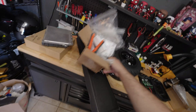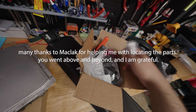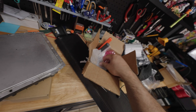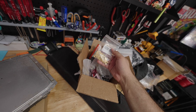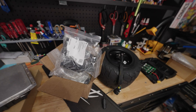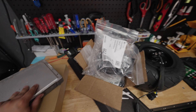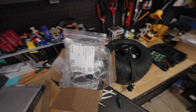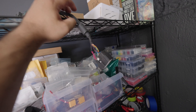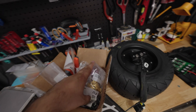Also, the box of new parts — from Mouser, Digikey, and Newark. These are the automotive adapters that the original Onewheel XR, Plus, and V1 used, along with crimps, bullet connectors for the motors, and a whole bunch of other parts. I will list part numbers in the description of each relevant video segment. I'm going to custom make the wiring harness rather than use one of those weird, messy harnesses typically found in an XR.